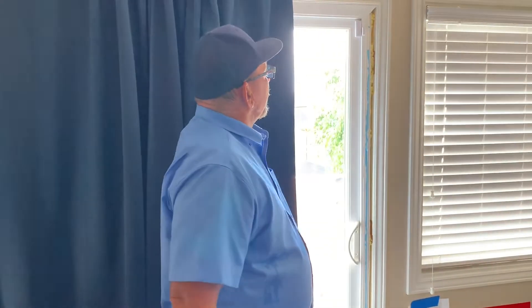If we run water all the way around this door it's going to leak all the way around. The right installation would have been to take everything out, break the stucco back, put in a nail-fin door, reestablish a moisture barrier, re-stucco, repaint — and then you have a job that's guaranteed not to leak. There you have it — hopefully this gave you the inside on how to pinpoint where that leak is. Thanks for watching; give us a thumbs up and hit that subscribe button.